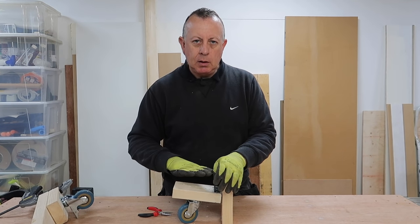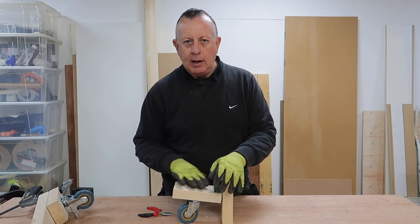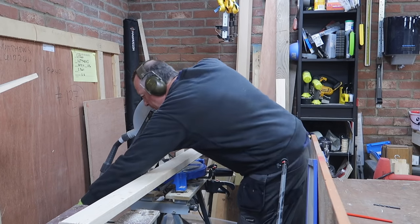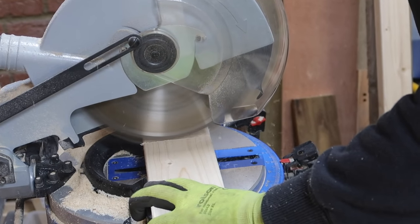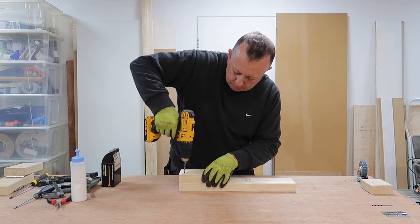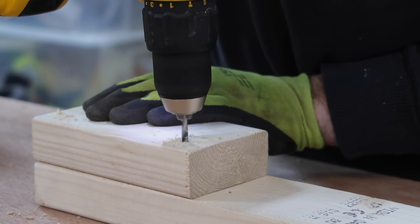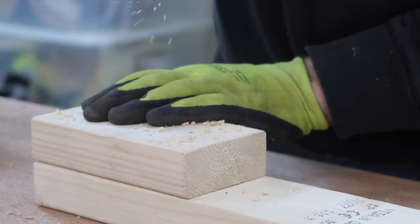What I haven't decided yet is how I'm going to latch the lever arm in position — I want to do it with my foot. I'm going to build this first and see how hard it is to push down, then decide on the latch. So it's time to start cutting some timber and fixing these hinges. The timber I'm using is C16 CLS 89 by 38 millimeters, which is slightly smaller than the 4x2 planed all-round I constructed the workbench from, which helps fit the mechanism into the space at the end of the bench.